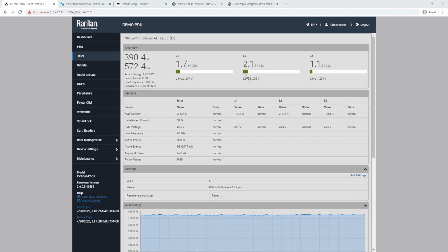One of the things I would add is to look at why we care about having the phases balanced in the first place. If you have 10% variance between the phases, it simply means you are leaving that 10% capacity stranded. It's not being consumed. It's not being utilized. That's the key on one front. And then there's the trickle effect upstream. If you have a row full of PDUs with the same 10%, that quickly snowballs into something bigger. That's a lot of stranded capacity and also a lot of stress on the other 2 lines. That's one way to look at it.